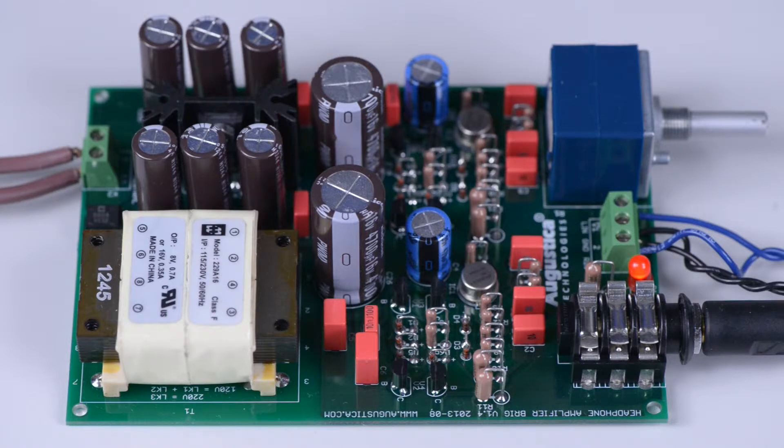The audio amplifier itself is built in a straightforward fashion. The main amplification device in the left and right channel is a high-end audio amplifier IC, which in each channel operates in conjunction with four NPN and PNP transistors, which together amplify the audio signal.